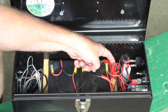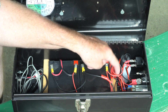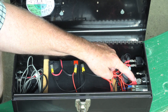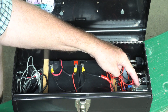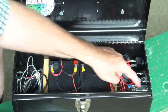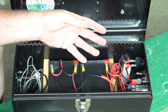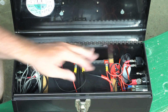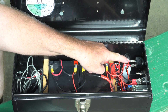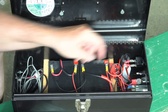There is also a terminal strip — you probably can't see it very well — but all of this is terminated on that terminal strip. So if I have a problem with something, like a cigarette lighter outlet, I can simply pull the quick connect crimp-ons and disconnect it, and still be able to use the rest of the system. I'd like it soldered, but this at least allows me to disconnect most of it. Some of the smaller components without tabs are still soldered but are terminated with quick connects on the terminal strip, so I can disconnect and continue.